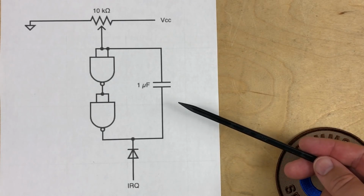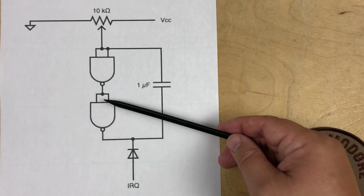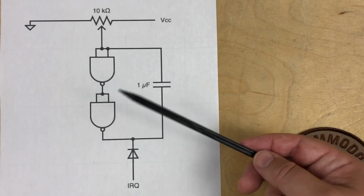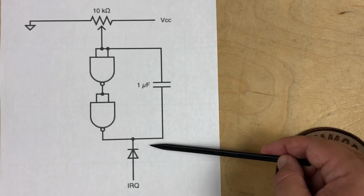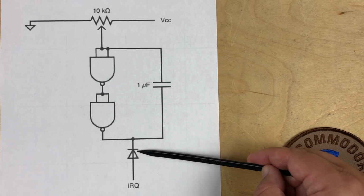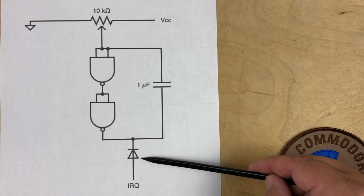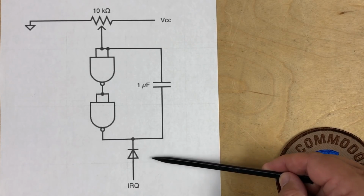Potential improvements that were suggested are to use a 555 timer, and the guys were actually wondering why this particular oscillator design was used instead of something like a 555 timer. Perhaps this was just cheaper, I don't know. Another option would be to also allow, optionally, NMIs to be generated, as that may slow down some software without causing the problems that frequent IRQs generate. Again, not as a primary way of working the circuit, but as an option, and it may allow more software compatibility if you could choose between IRQ, NMI, and maybe even both.